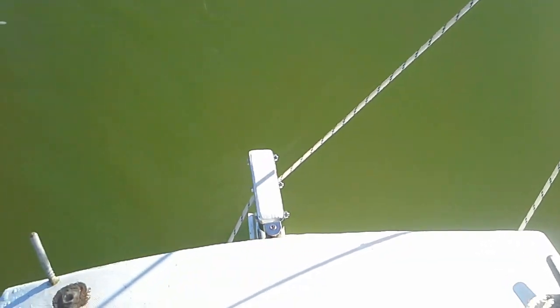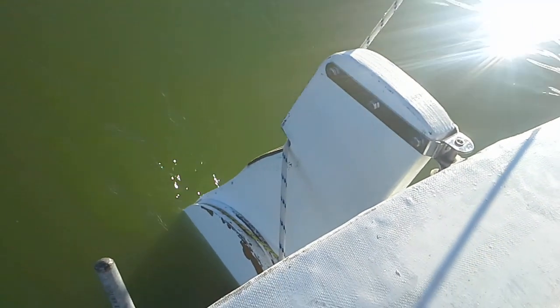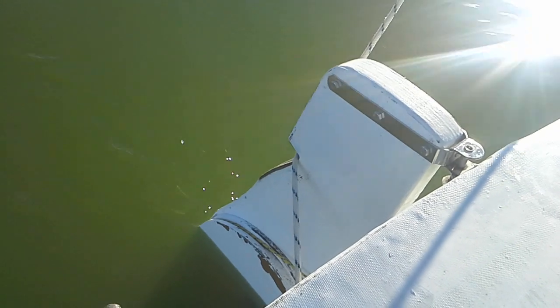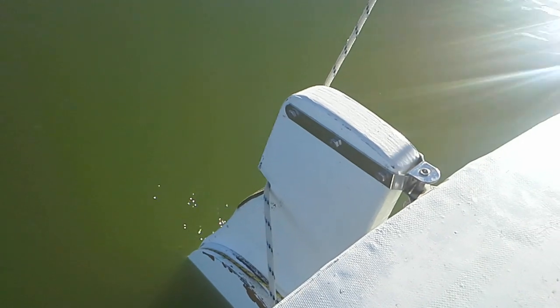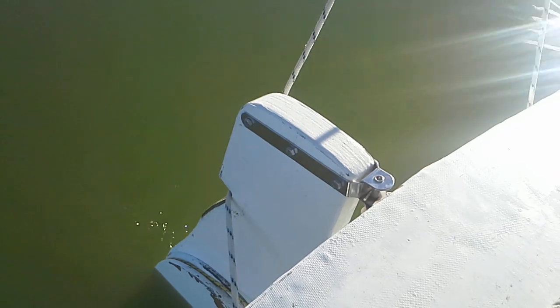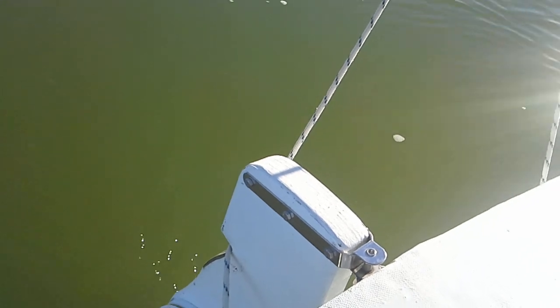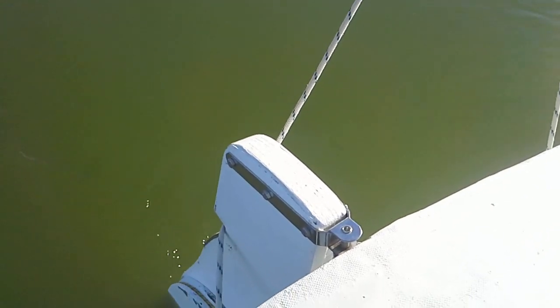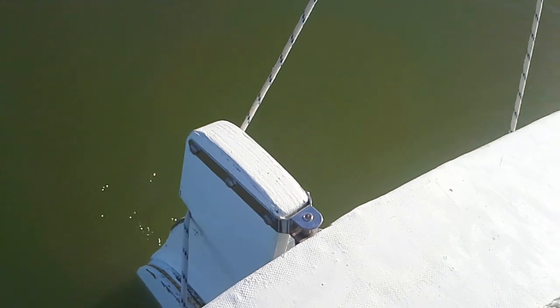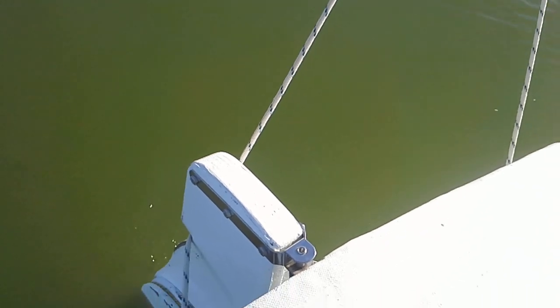If we come back here and have a look over the back, you can see I've cut a slot there in the back of the rudder. That's designed to catch the line so that it doesn't come up and sit over the top of the tiller. That works quite well most of the time, unless you're going upwind and you've got the boat pulled in very tight — it misses then on one side only. But every other point of sail apart from hard on the wind, that notch catches the sheet and holds it there.